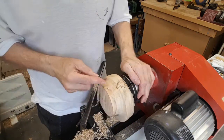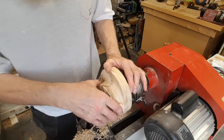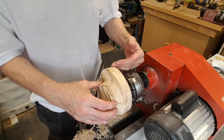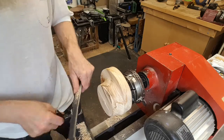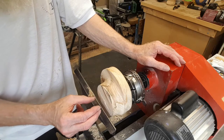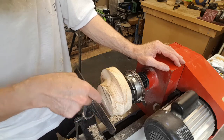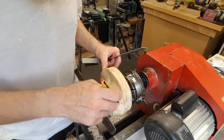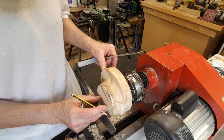That will be fine for the moment — I'll need to take another couple of finishing cuts — but at this stage that's taken the bulk of the material away, so it's more centrally balanced now and we've only got excess weight on this side. The next piece to do is mark out the tenon that we're going to hold the piece in the chuck, and then we can start turning the outside shape of the bowl. It's a fairly small bowl and I want it to be fairly rounded, so I'm going to use a set of jaws that have a 40 millimetre tenon.